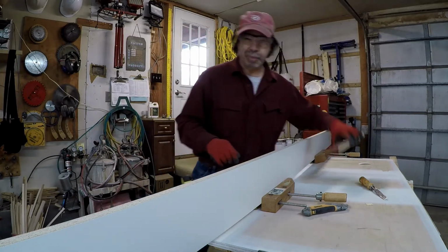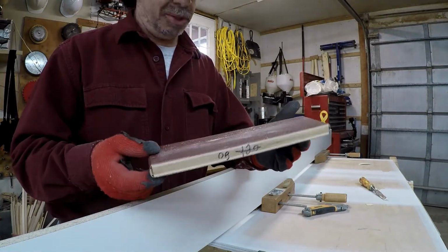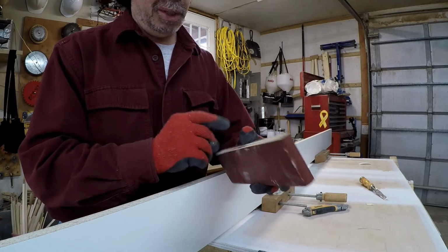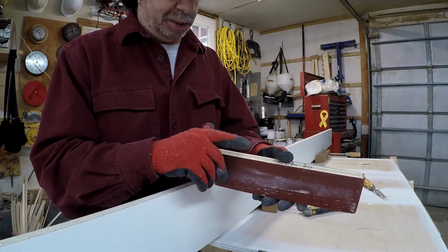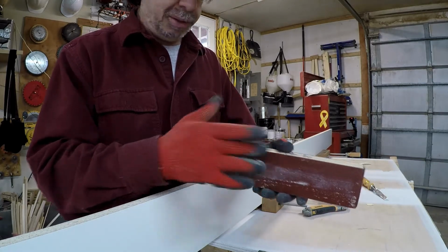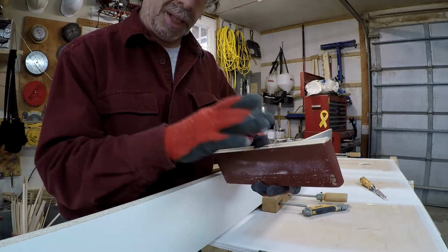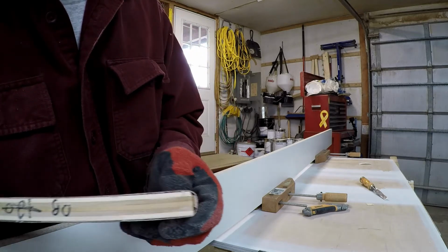And we're going to repeat our process. Now this is nothing more than a sanding belt that's been put onto a piece of plywood. So if you want to make one of these in the shop, they're very easy actually. Take and cut a board a little under the size that you actually would need to fit in here, so that it slides in and out easily.